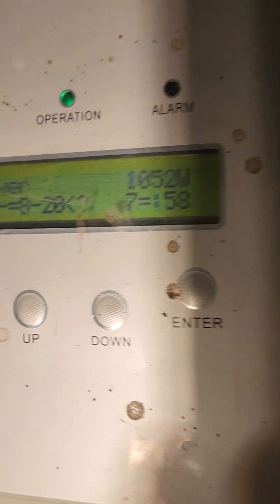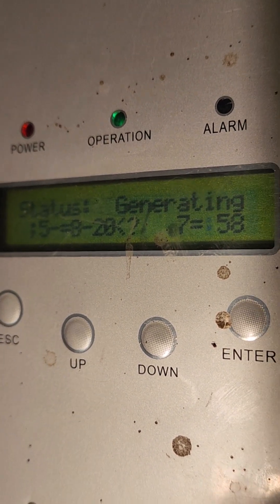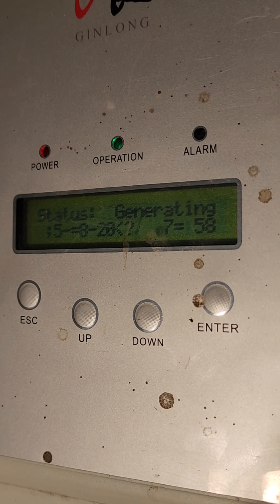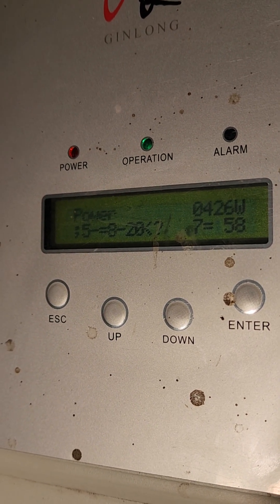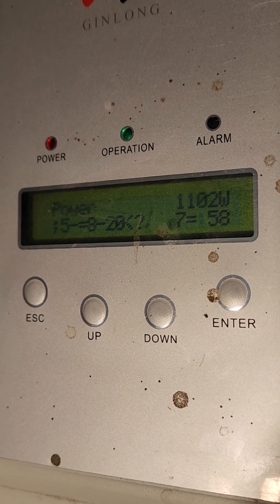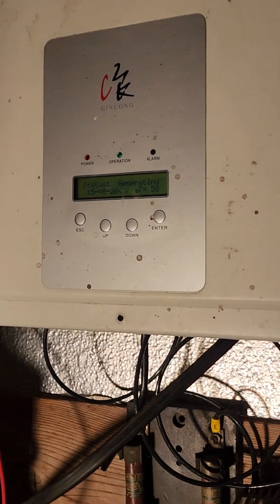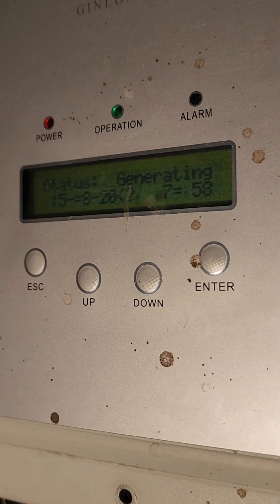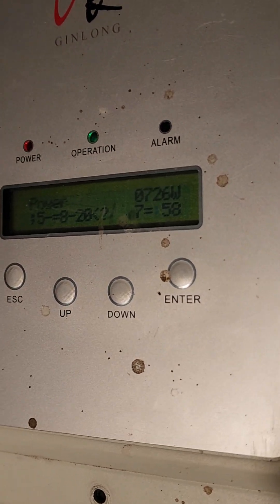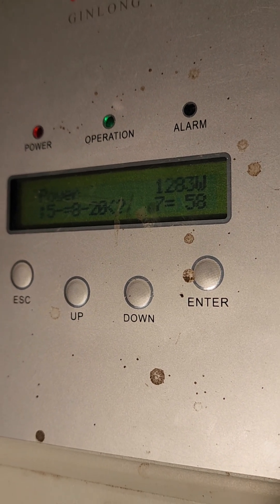You can see the kind of output a 10-foot turbine is producing. It seems quite happy to be producing over one kilowatt sustained, which is not bad. It's dropped off a little bit there. I've had that inverter kicking around for a while, got it installed today, and it's fun to see how it's working. There we had 1,800 watts — we're pushing the limit of this little inverter.